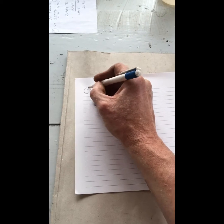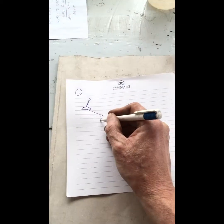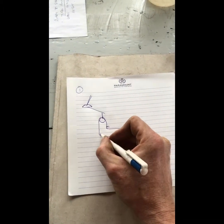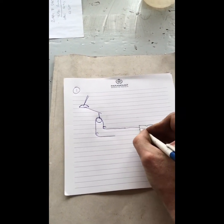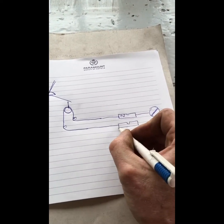There are two ways of doing this — I'll show you on a drawing. So here's number one: we have our lever in our signal box, and what we can do is use the lever tail itself to do the work. Here we have a draft wheel on our lever tail, and around the draft wheel our wire goes out to our signals — I'll just draw some small pulley wheels there. Here we have our mechanical detector on the ground; we'll say this one is the normal detector that will go to one signal.